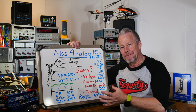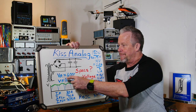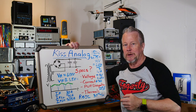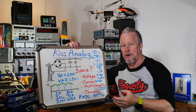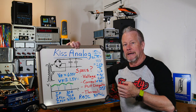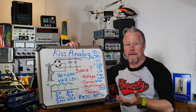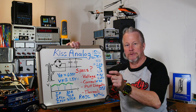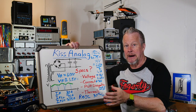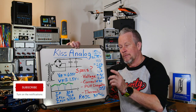The other thing we care about is the voltage drop across the conducting diode — we like it to be really small, like a Schottky at 0.4 volts. A lot of times we use regular silicon diodes in bridge rectifiers and think 0.6 to 0.7 volts, but these higher voltage power diodes in large packages can be higher, like 1.5 volts.